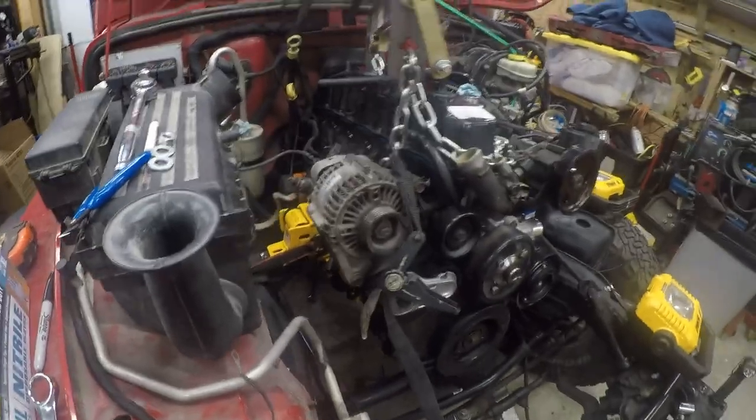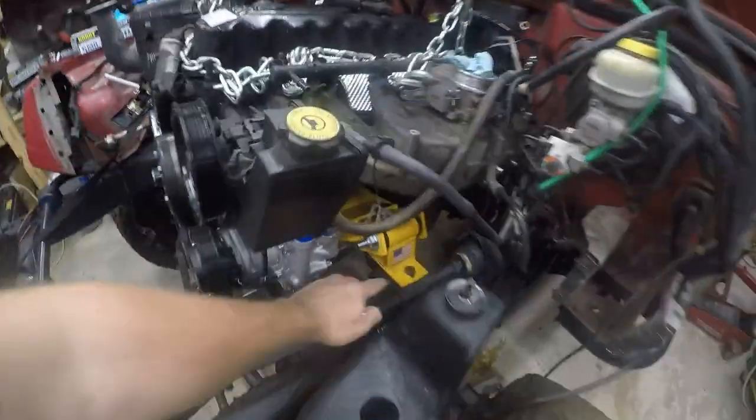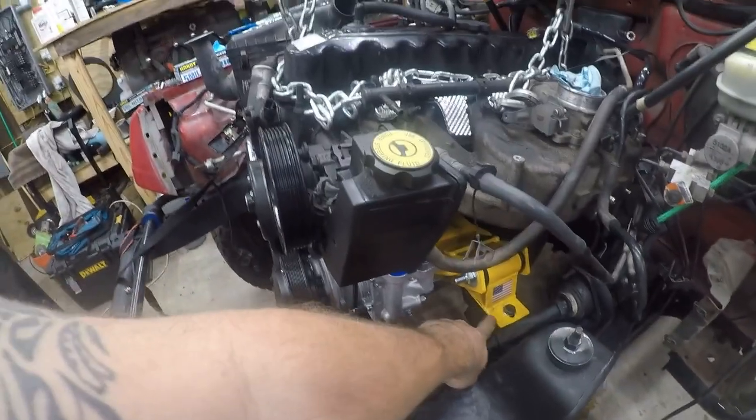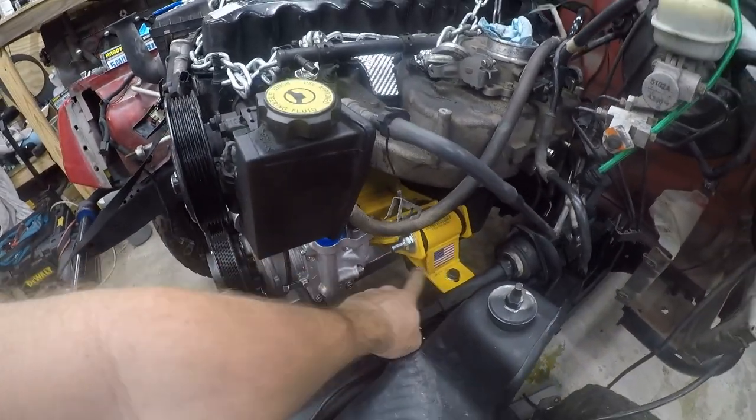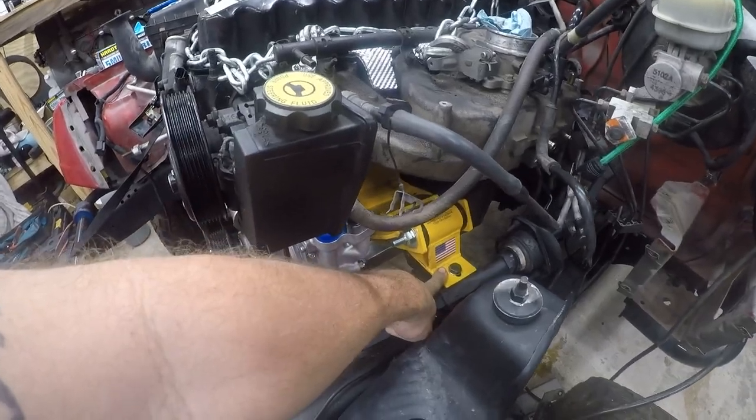And I've got a f***ing problem with the motor mounts. So I knew there was a possibility that frame repairs might not be so easy. So I used a strap. I was able to drag this one over maybe half an inch. So I've got this one in. This is the one that was damaged. This is the side of the frame that was repaired.